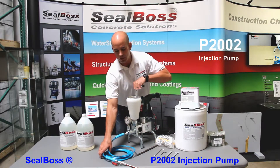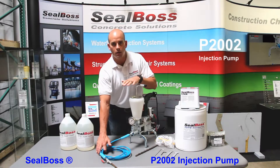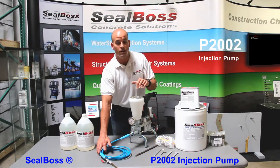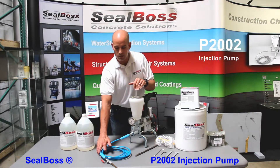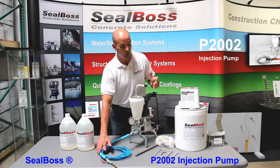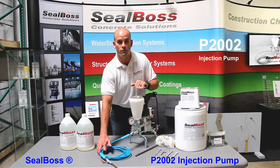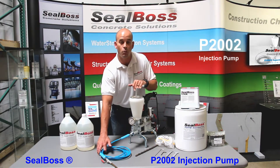Typically I like to go no more than about 4,000 psi, and as the applicator becomes more familiar with the injection, they'll start to say that they can feel it as the pressure starts to rise. They can start to feel that back pressure at the nozzle. That's an indicator of two good things: one, your injector is starting to learn the nuances of injection, and two, that the material is reacting with the water in the crack and giving you back pressure because that resin is now becoming a closed cell hydrophobic foam.